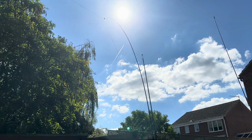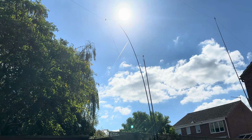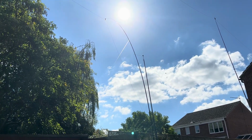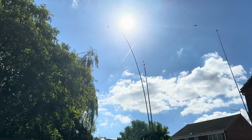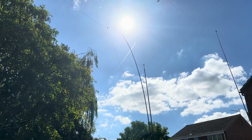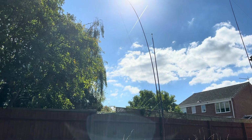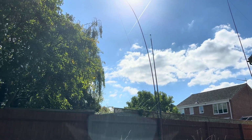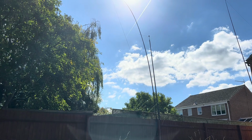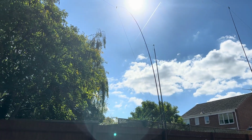I had assumed that it was so bad, actually. I think it was on 80 metres, it was actually 6-1, so it's horrific. Although my Kenwood, I had no idea at the time, because I generally don't tend to get time to measure the SWR before a sked because of work, family commitments, etc. And the Kenwood handled it with its built-in auto matching. Still not a very good idea. So when I measured it being 6-1, I was like, oh my god, what's going on?